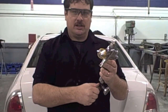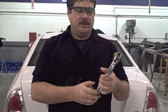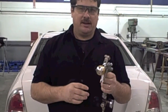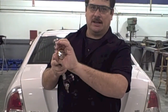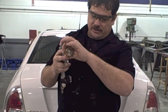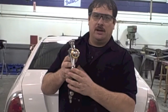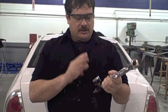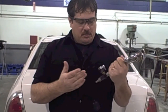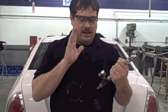The first adjustment is air pressure. You can see I have a gauge right here and I can adjust the air pressure right here. The problem is that technical data sheets often list PSI at the air cap — that's how many pounds it's actually getting at the nozzle — and most guns don't have a gauge up there. What's going in is not what's coming out, so it's going to be different. Most products you're spraying will be somewhere between 18-25 PSI at the gun.